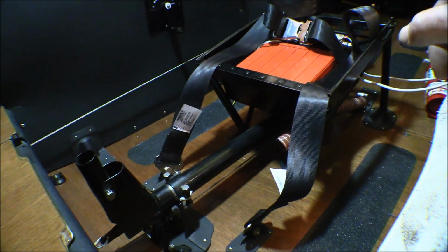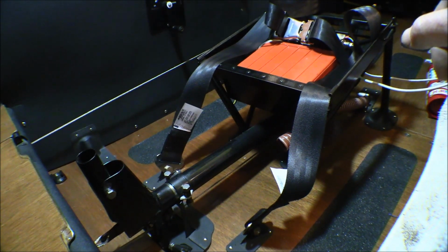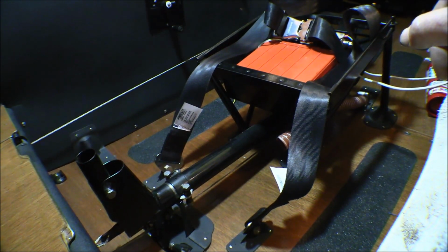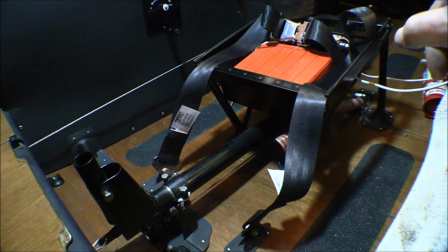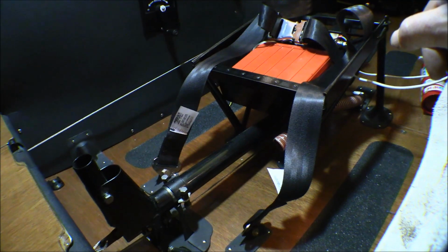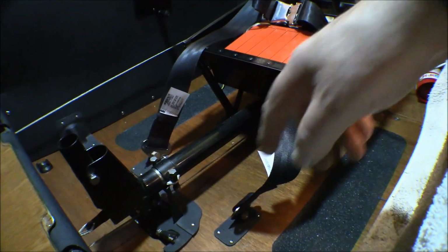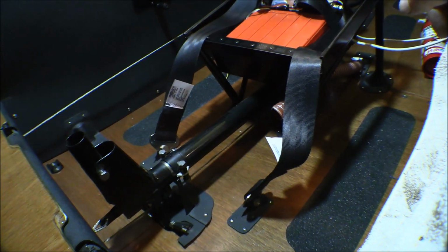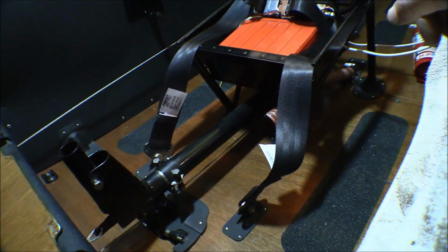And in the back seat, they attached it to the back of the V-brace back there and attached the shoulder harness to that. Well, in this fuselage, when I had it built, I had tabs put in there to put shoulder harnesses in instead of using those clamps. And then we had tabs mounted in here on the fuselage on one of these members down here to attach the seat belts directly to the floor instead of the seat. So we've got a lot better anchorage there.